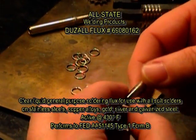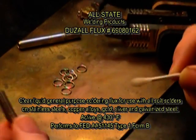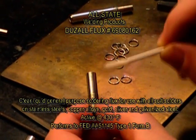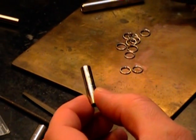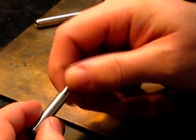The flux I'm going to use on this is a fairly aggressive flux. This looks kind of like stainless steel, but it's not — it's a nickel-copper-zinc alloy. It's going to take a little more aggressive or acidic flux than you would use for something like a copper or silver finish. So we'll just put a little bit of that on there and spread the flux slightly.